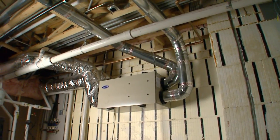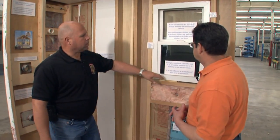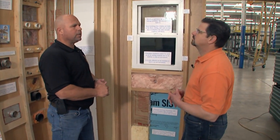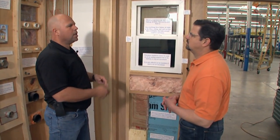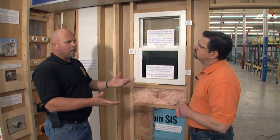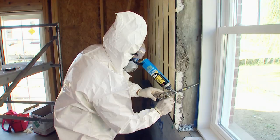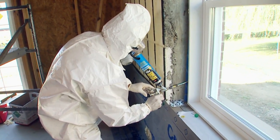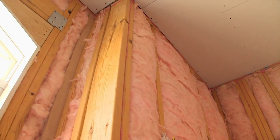You have your vent piping, some electrical conduit, light switches, and even your window insulation. Our windows — typically there's a piece of newspaper we found in an old window during a remodel. They used to shove newspaper around the window openings because they knew they were trying to stop that air draft. Then we came along with fiberglass insulation, but fiberglass is great for a filter — it's on your furnace, but it doesn't stop the air. So what we do now is a little bit of spray foam. Shoot some spray foam in there — you don't have to fill the whole thing, you just need enough to stop the airflow from the outside to the inside — and then you can fill the rest of that opening with fiberglass or more spray foam.